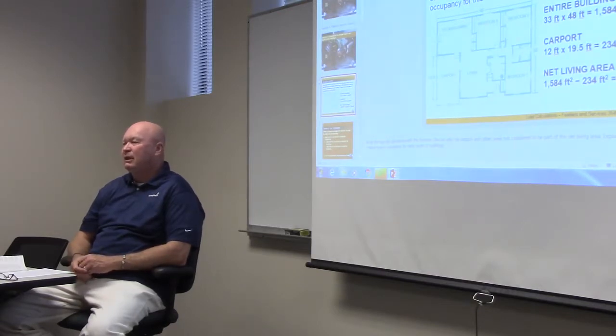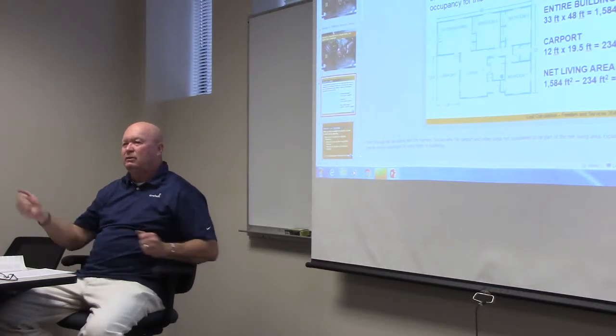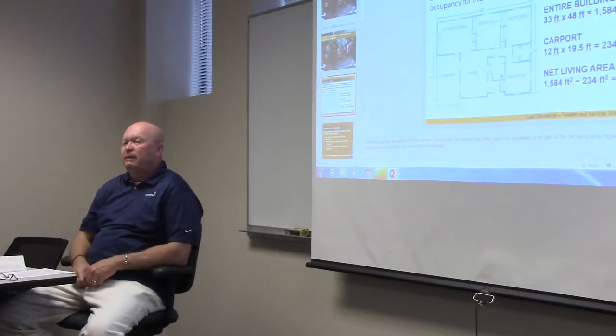What size lanyards do you have? The 6 foot. Is that a normal six foot? Get your yo-yos, where you're backed out. Now, what does the yo-yo do? You can just pull out a certain length. It's like a seat belt on your car. If you pull it slow, you get 10 foot or whatever, but if it's a quick jerk, it'll catch itself. They're a lot safer. I think we have some of those, but I bet they're kind of cumbersome, aren't they? Some of them are. Some of them that I've worn are not too bad.